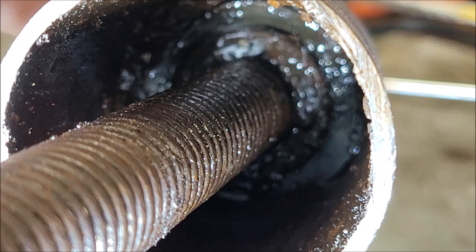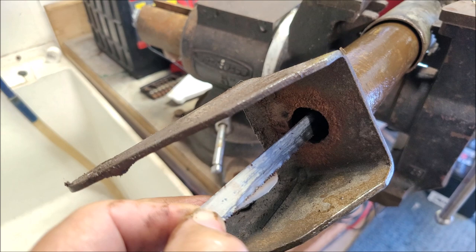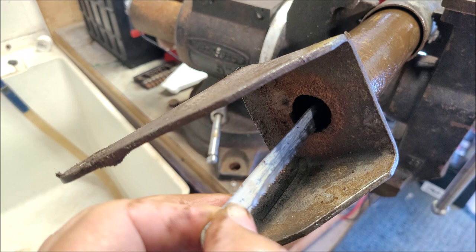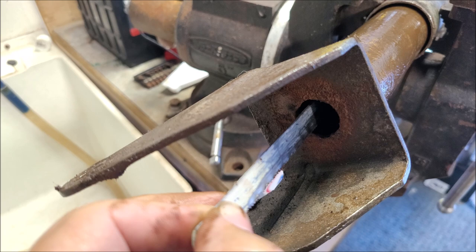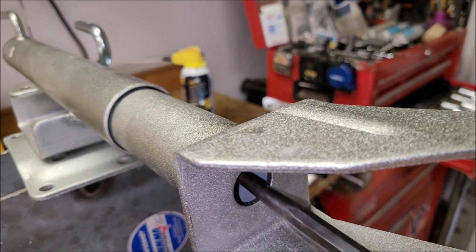So how to fix this? I think I've got it figured out on the new one. At the bottom of the jack is a hole, and by placing something long enough inside I found I could touch the threaded rod. The threaded rod is open all the time — so if you put it in saltwater, saltwater is going up this hole and rusting out the threaded rod. I do have a solution for this. Maybe the problem all along has been inside here that we need to take care of.